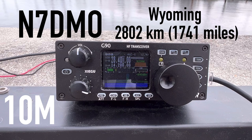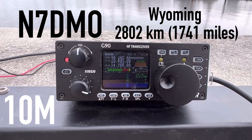N7DMO portable — we got a QRZ from N7DMO. Kilo 4 Oscar Golf Oscar, this is November 7 Delta Mike Oscar portable, go ahead. QSL, thanks for taking the call. I'm portable as well, just 20 watts in the harbor of Norfolk, Virginia. You have a lovely signal — you're 57 on the S-meter, but you sound like a 59, just great audio. Okay, I'm not using anything fancy, just a little Kenwood handy-talkie retransmitting back into a Kenwood TS-2000 XL Limited Edition, putting out about 100 watts to an inverted V with the apex at about 43 feet.